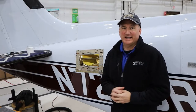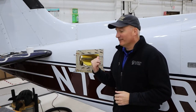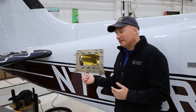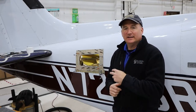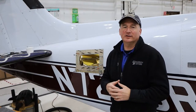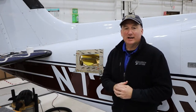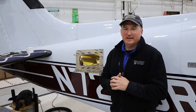So it's not every day you get to put a saw to the side of somebody's airplane, but that's part of the process here as we cut out these holes for the condenser vents. Since it's stress skin, we've got to install these doublers, and that'll have a nice fancy cover that'll go over that. And on the inside, we're beginning to lay out the rack that the condenser and the compressor and all of that will start to sit on. So hence the building the ship in the bottle, but so far it's been mostly on the outside. We're heading inside pretty soon.